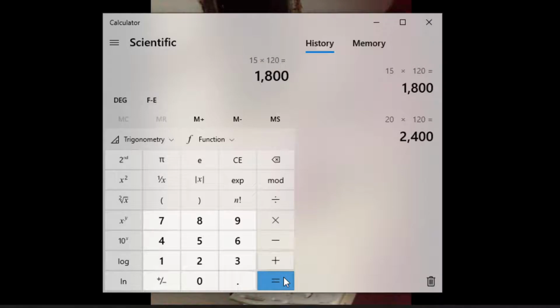So if you put a 2,000 watt circular saw or whatever on this thing, over time we're going to pull a little bit too much power. With a 15 amp breaker, you're going to be using your saw, you're going to be halfway through your cut, and then all of a sudden the breaker's going to trip. You're like, why did it trip now? Why didn't it trip when I first started cutting?